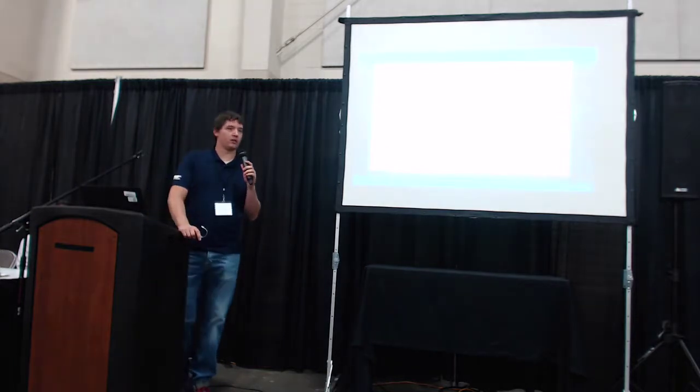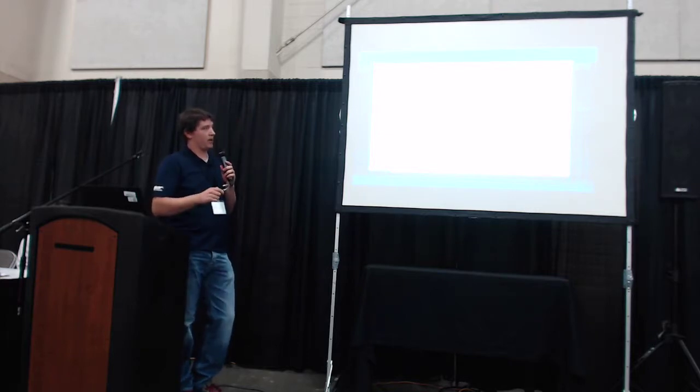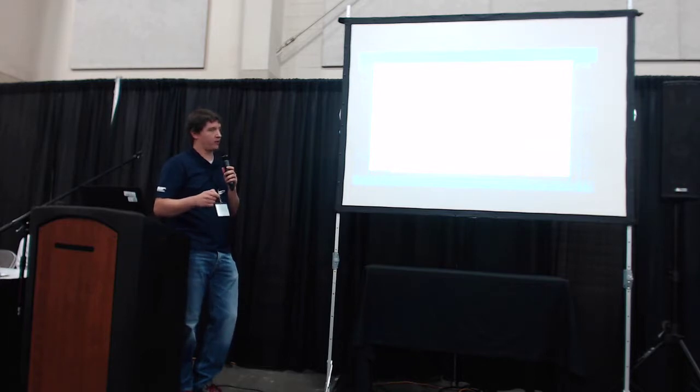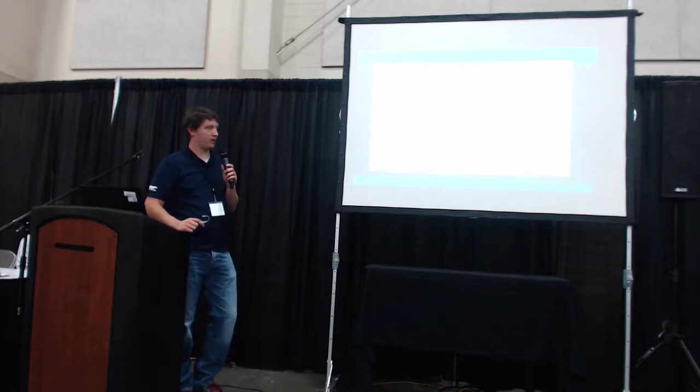I briefly touched on yield earlier. As a department, we have this yield spreadsheet that's really easy to plug in. You can just type in the length in feet that was paved, your average width, your depth, and there are some adjustable numbers. If you're just doing a quick calculation, you can use the average Rice value from the previous day. If you really want to get right down to it, you can use the Rice value for that day after you get the results from the tests. And then you can just throw in your target compaction. If there are any questions, you can always go back in once you get your compaction results and do your average compaction. In this example, the yield is saying you only needed 560 ton, but the tonnage from the tickets is 570. So it's a 2.5% overage.